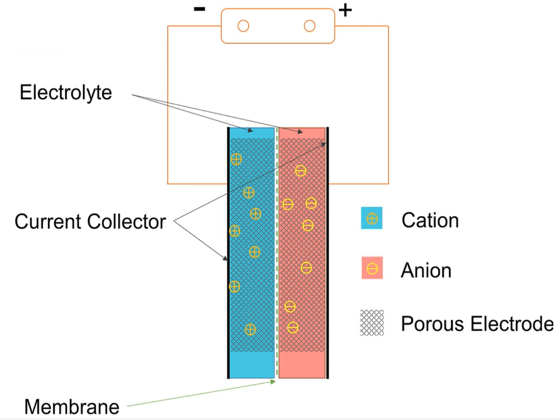C_total = I_discharge · C · (T2 − T1)/(V1 − V2). The value of the discharge current is determined by the application. The IEC standard defines 4 classes: memory backup, discharge current in mA equals 1·C (F). Energy storage, discharge current in mA equals 0.4·C·V (F, V). Power, discharge current in mA equals 4·C·V. Instantaneous power, discharge current in mA equals 40·C·V.